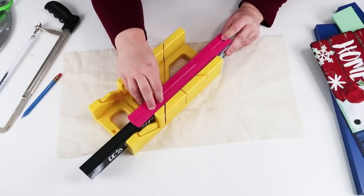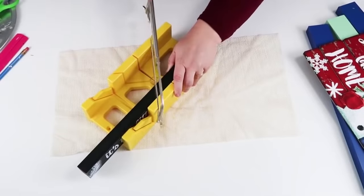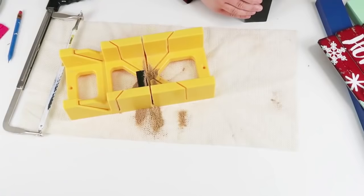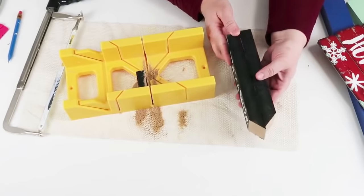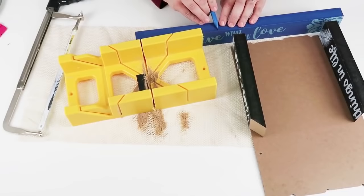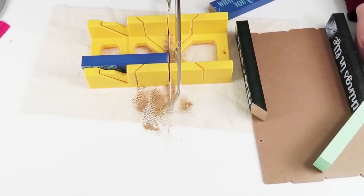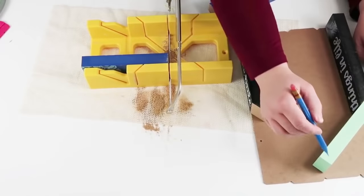I'm going to cut that in half, find the exact half point, and use a 45 degree angle cut standing it up on its side. I've got these two pieces that are the same size and now I'm going to figure out the base, marking it off — it just depends on how wide you want to make it. Today friends, we are making a really sweet nativity scene. For the rooftop we're going to use one more sign, and we need a 45 degree angle for where they'll miter together at the top, with flat ends.